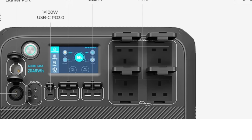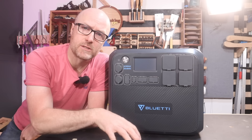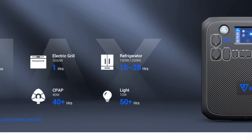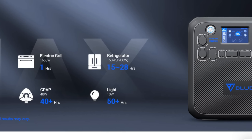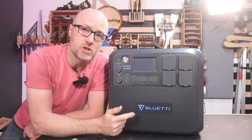This has got four outlets for a three-prong plug so you can run four machines off it. You can charge your phone on top and there's a load of different USB sockets as well. For the woodworkers out there, these are the important four — that's power out. Inside this you've got 2048 watt hours. Every tool you plug into it is going to drain a certain amount of watt hours, so you've got to make sure this has enough to cope with each one added up. It also has a surge of 4800 watts, so if you plug your table saw in and it starts up without a soft start, you've got to make sure that initial surge is covered. Spoiler alert — there were problems.